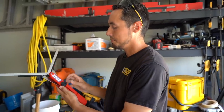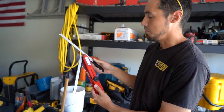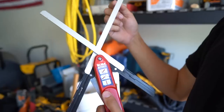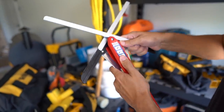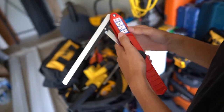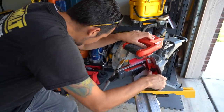For an outside cut, the arms still move simultaneously, but these pieces — they look like tiny aluminum extrusions — slide up on the black arms. As they're sliding up, that gives you your outside miter. You'd push this up against your corner and lock that down, then lock it down again. The right side of the tool detaches — it's always the right side that becomes irrelevant. Then you push the extrusions back down. Now you go to the miter saw and make the cut on the right side of the zero-degree mark.